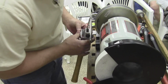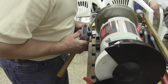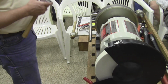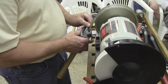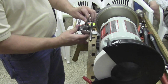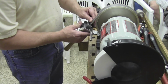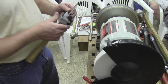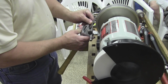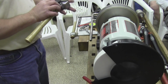Oh, I've got to put it in there correctly. Now that's just a straight skew, and I hone the dickens out of these things when I use them. Basically, this is a 20 degree angle. Skews always take a long time to sharpen because you've got a lot of surface area. So they'll generally take more time, although it's much faster on this than with a grinding wheel, and it doesn't load as much, but you can see the fine metal particles it's kicking off at the bottom.